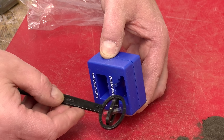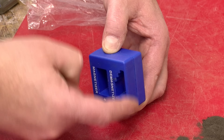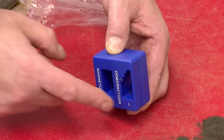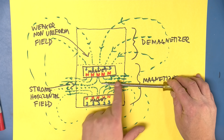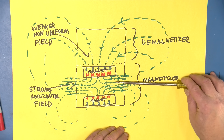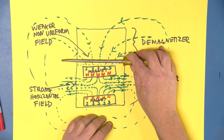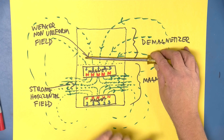What it is, is there's a magnet in here and that magnet is facing up, so we have some magnetic fields coming out of that. The other clue is this part of the demagnetizer is much thinner than this part of the magnetizer, and that's because there is another magnet in the magnetizer but none in the demagnetizer. Over here the field is nice and uniform and parallel with the screwdriver, so it leaves a lasting impression — a nice strong field. To demagnetize it, we put it over here where it sees fields going somewhat at an angle; the further we move out, the angle changes from vertical to off-vertical.